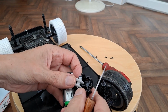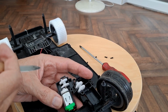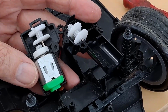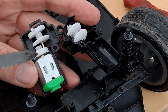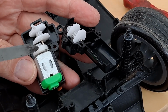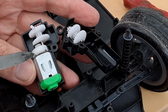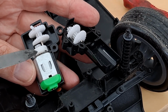We've got some gears in the top and some gears in the bottom. Okay, so motor, let's zoom in down there a bit so we can see it. Motor with a clutch assembly on it, or probably not clutches. Yeah, it is. Oh, I remember those. It's got two little plates that spin out when it builds up speed, so it actually grips when it's going fast and releases when it's going slow.